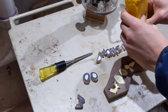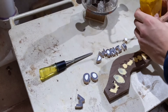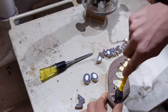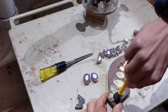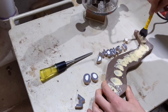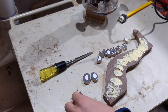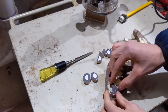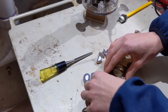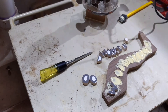You might be wondering why I put the glue in the two O's before I started the camera — that's because that's where the message was written, so if I hadn't put the glue in, you could have seen what the message said. This little rubber glue brush is not at all a necessary thing, but I very much enjoy using it. It might even take me longer than using my finger, but it's so much fun to use. I then just press the contrasting letters into their routed spaces. After I turned off the camera, I came back and squished everything in a vise to make sure it had properly set.